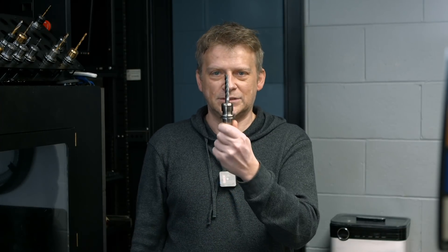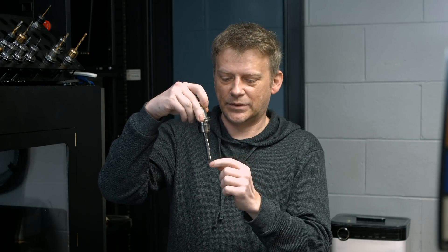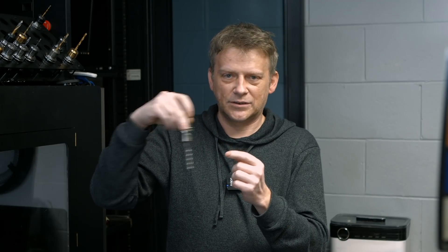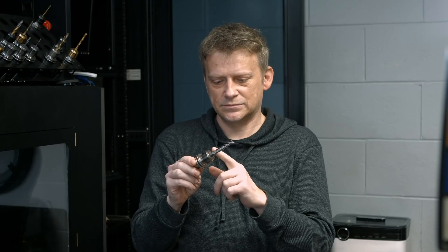I hope you liked what you saw. I have one more example. These are going to be pictures because it was a top secret job, and I think I can show that much. I was using that end mill to cut the part all at once — ouch. I was considering going bit by bit, but then it would be deflecting only at one point. So I thought, screw it, I have to go deep anyway, so I'm going to be cutting all at once. It was a 45 millimeter deep cut, almost all the flutes — I left five millimeters — and it worked just fine.